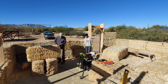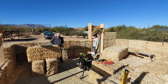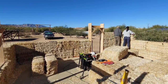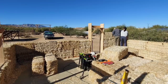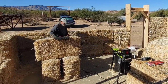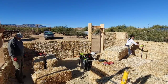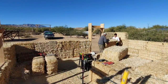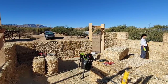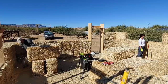We want to make sure that it lines up with the bale below it and that we're trying to keep our wall as vertical as possible. We know there are going to be corrections to be made, and the corrections can be most successfully made after the top plate is installed, but we do our best to keep it vertical for security and stability reasons. Here you see me shaving another bale, and then Yvonne is very conscious of the fact that the bales need to be flat — she likes to lay them down and tamp them before we place them up. Once the bale has been placed, we tamp it down to flatten the top and proceed with the next bale.